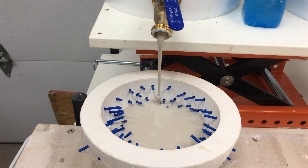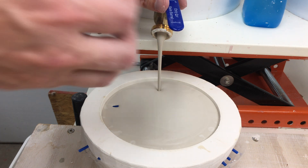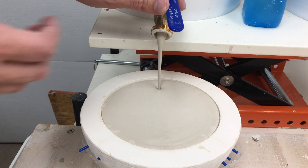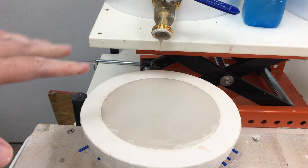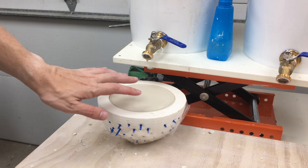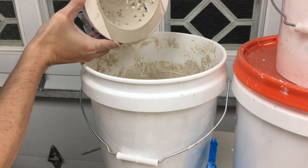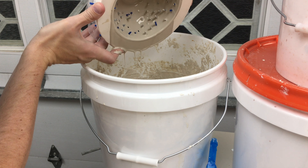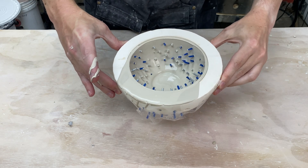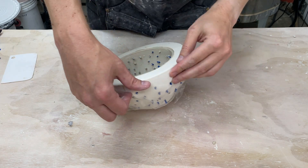My other concern is that because the tolerances are so loose, the slip is going to leak out of the holes. So far, so good. Since it's only half a mold, I don't have a slip well, so we'll just fill it up as far as we can. I'll go ahead and let that sit and check back when it's time to dump out the slip. Let's see if we can dump it out without losing all the wax pins. I can see slip draining off a lot of the pins — that's a good sign. I want to pull all the pins, which means I need to remove the tape.